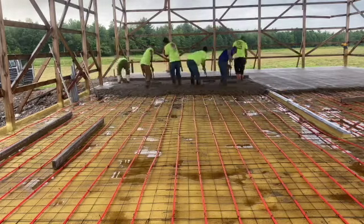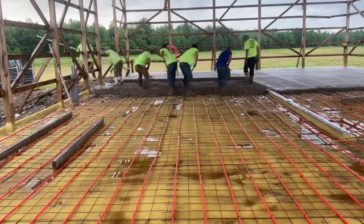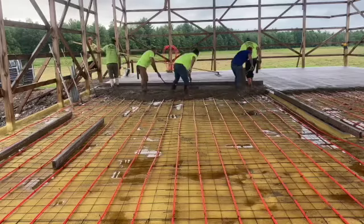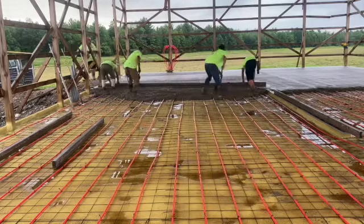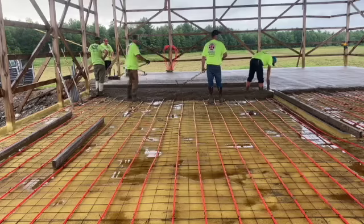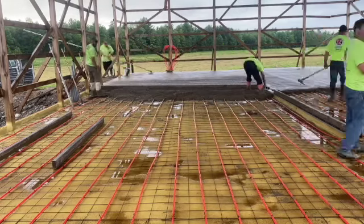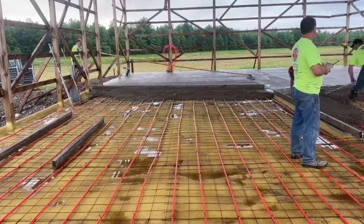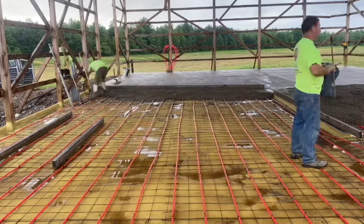You can see now we're using that 20-footer, guys. It reaches from the edge right to the drain. Kind of a big screed stick to pull, but we got enough puddlers behind it. If you keep it raked down nice, they don't have to pull a lot of material. Makes it pretty good. See, Big Biscuit's back there floating. He's coming through the doorway.